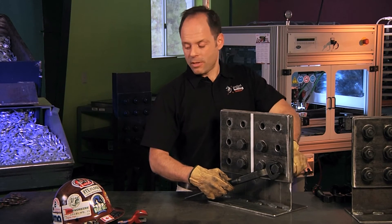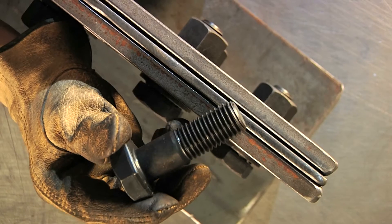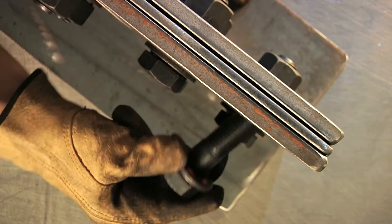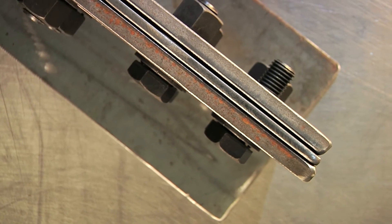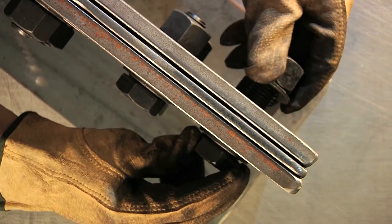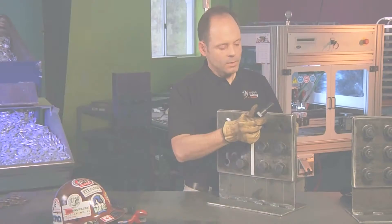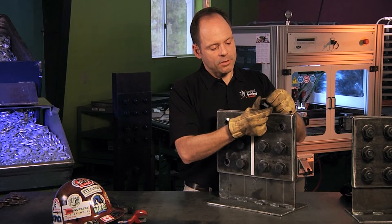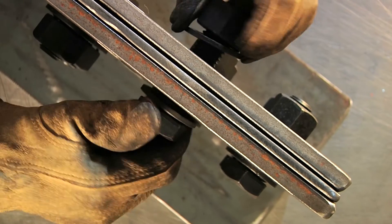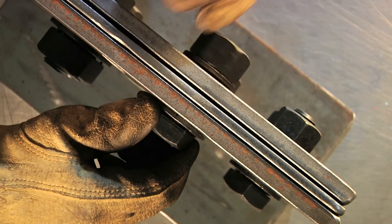Let's stuff the rest of the bolts. Once again: bolt, DTI bumps into the bolt head, and insert that through the steelwork. We're going to have our flat washer and our nut. Bolt, DTI bumps directly against the bolt head, through the steelwork, flat washer, then our nut.